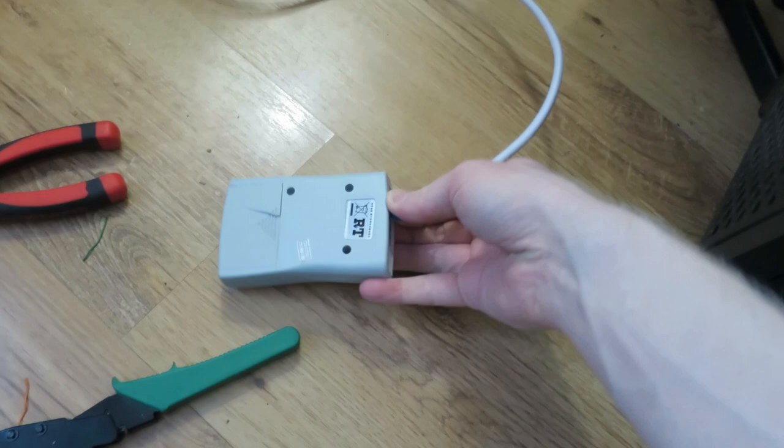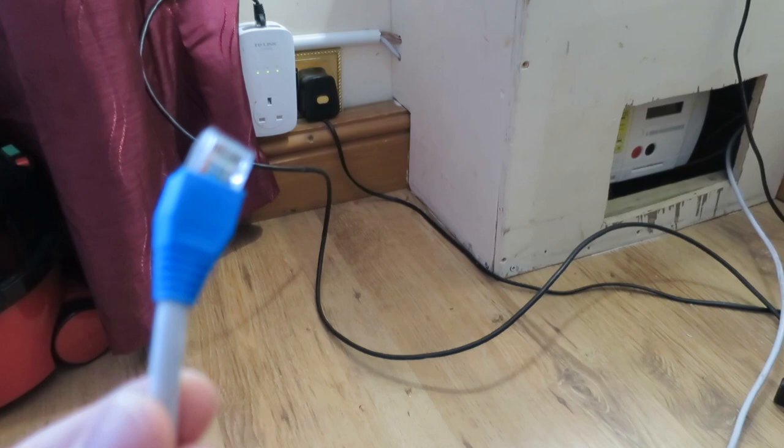Now, it's highly likely I've done this backwards. Tiredness might have kicked in and I've done this completely backwards. Let's just double check that. Annoyingly, my pinout on the RJ45 is looking perfect. So this leads me to believe that I went somewhere wrong with installing that faceplate, which I said earlier, I hope I did it right, because it's going to be a complete pain in the ass to get to. But it looks like I've done something wrong with that guy. So I don't quite know what.